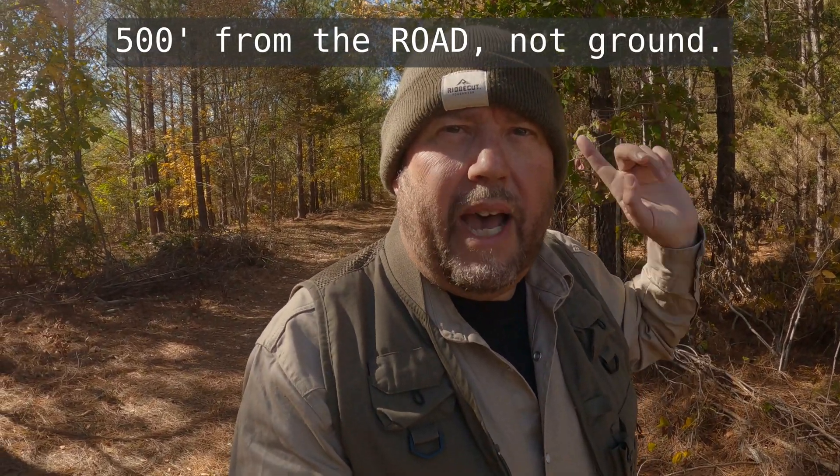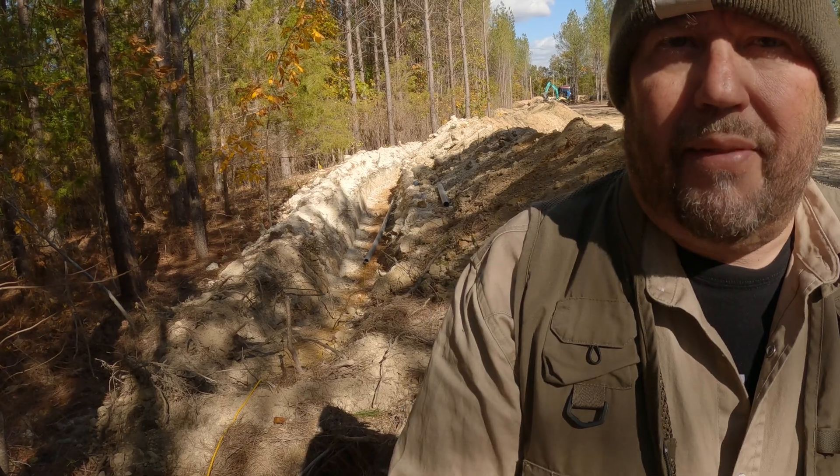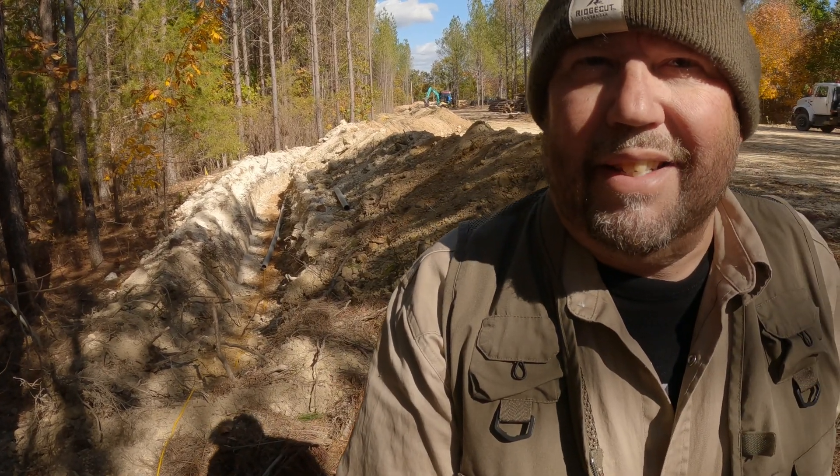Here I am behind the big turnaround area — about 500 feet off the road. I've got the north fork behind me and the south fork is over that way. What we're going to do is have the three-inch terminate about here. We're not going to do a sweeping elbow to bring it above ground because I'm not exactly sure where a transformer or junction box is going to go. So we're just going to feather the three-inch above ground here, and when we do add on, we can just tack on to here without disturbing the front of the property.